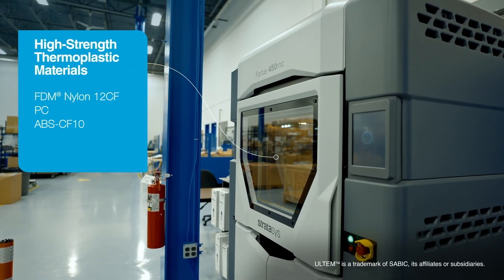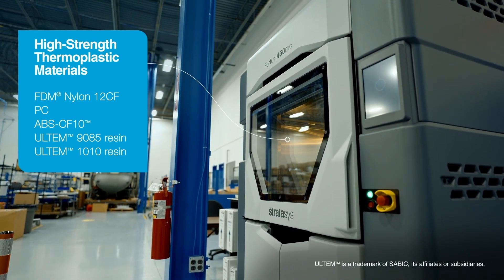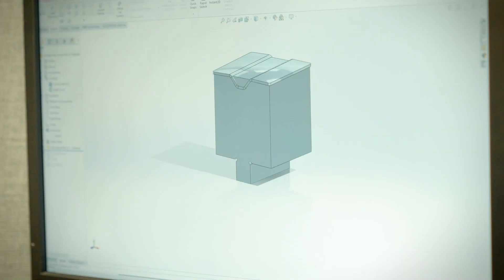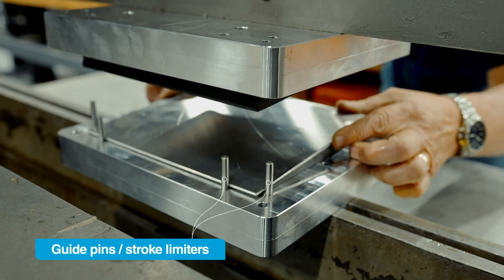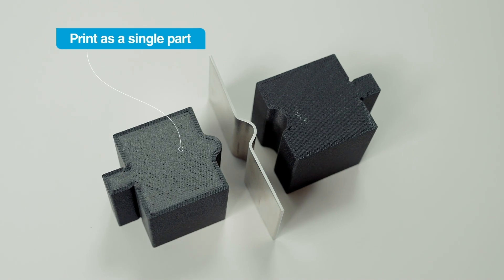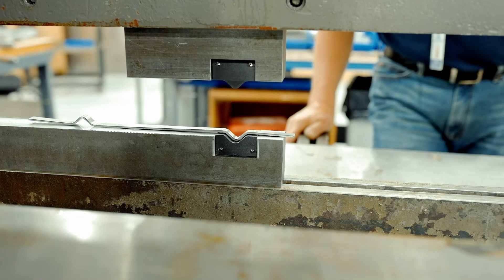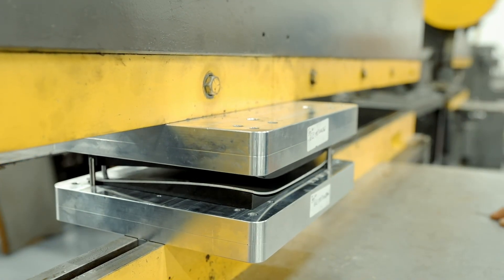Based on the requirements of your forming operations, Stratasys has several high strength thermoplastics available to choose from. Here are some considerations when designing your 3D printed metal forming and press brake tooling. Create your tool using the same design philosophies used when designing metal tools. Be sure to include guide pins and stroke limiters where necessary to prevent tool damage. It's preferable to make the tools as a single 3D printed part to prevent weak spots. Under the forming pressures, an FDM tool may have a small amount of deflection that decreases or eliminates the amount of spring back in the sheet metal component.